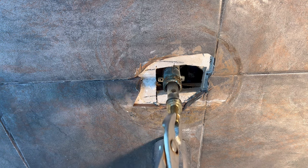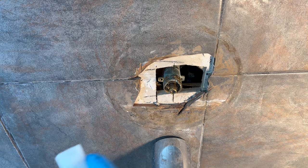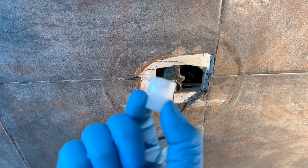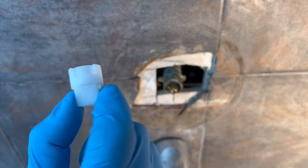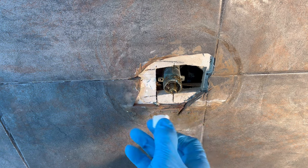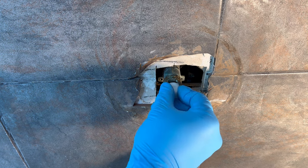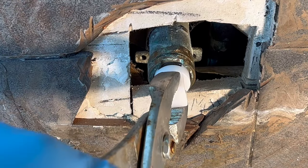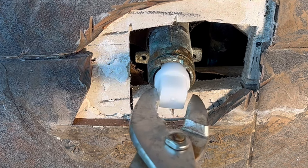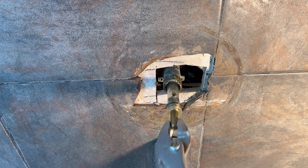I put the cartridge back because I realized the new cartridge in the packaging actually includes a cartridge removal tool. So if it gets stuck really hard, you would need this — place it in there and give it a turn. Now it's loosened up and then you can go ahead and use a pair of pliers to take it out easily.